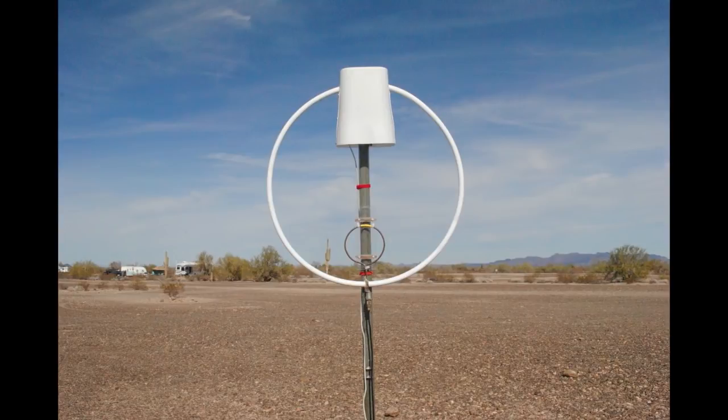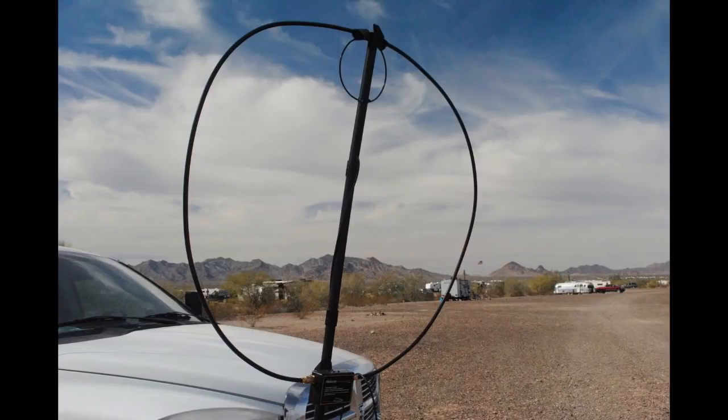Maximum power will be a figure 8 in the plane of the loop. So right now, if we were to look at that loop, we're not hearing much power. And the short whip or a short dipole is capacitive, and we normally load them with inductance. This lowers the Q, ups the losses, and conversely, the very high Q and lower losses found in the loop does a marvelous job when tuned in properly. And Jim's going to tell us all about what it takes to make the right type of loop.